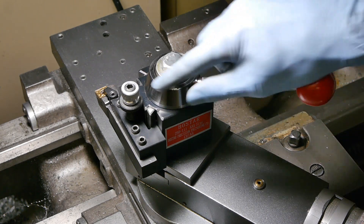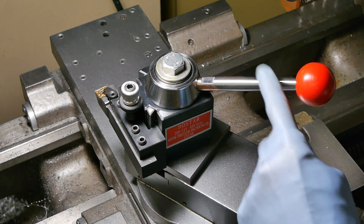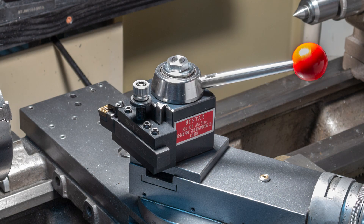The fact that there's very little play now in this collar is nice — it feels better, though I'm not sure the play in the collar was of any functional consequence. The last thing I did was rework the handle and take out most of the big ugly scratches that the tool post came with. Looks a lot better now, doesn't look so beat up. So that's the story on this imported tool post. If you buy the high-quality version, I suspect you would get tighter tolerances and hardened components. Would I buy this for a commercial shop for everyday use? Certainly not. But for a home shop machinist like myself, it's serviceable and does the job.